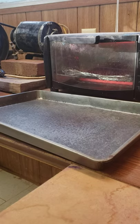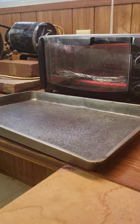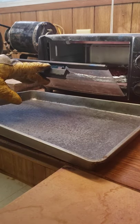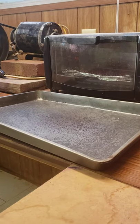This is all it is to it folks: put them in a Tupperware jug with some powder coat, shake it up for a few minutes, strain the excess powder off, put them on a plate, throw them in the little toaster oven, and you're done. It's good to do this in a ventilated area — I got all the windows open in here, I'm surrounded by three windows, and I got an exhaust fan over there. We'll look in a minute and see what it looks like. They're just about totally done — one more minute.